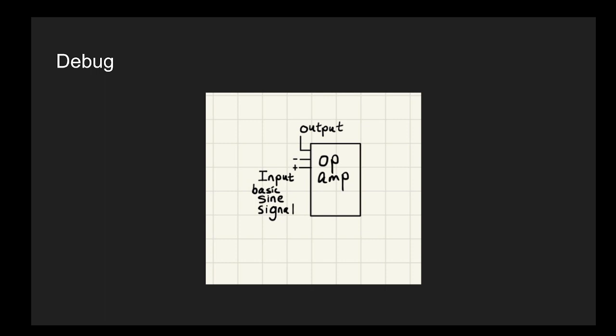There are, however, some situations where my circuits and settings are correct, but the recorded results are just not satisfactory. I would then assume there's some malfunctioning component. The first thing I would replace are the wires, because they are used by everyone and some of them are old, so it may cause some bad connections between the function generator and my circuit. If the problem was not solved by then, I would replace critical components in the circuit, such as the IC or the BJT, because they are the most vulnerable components in the circuit.